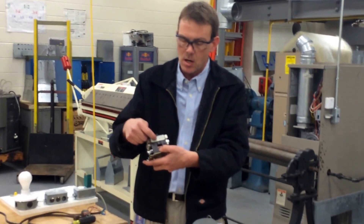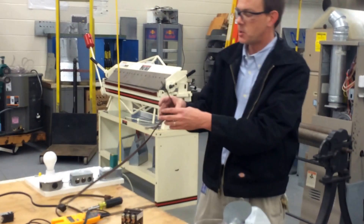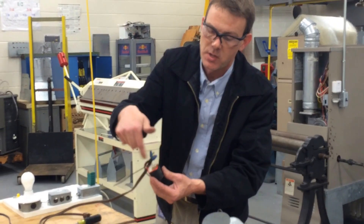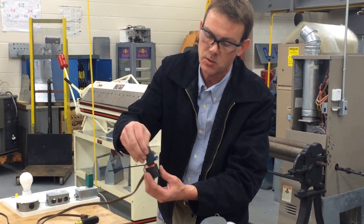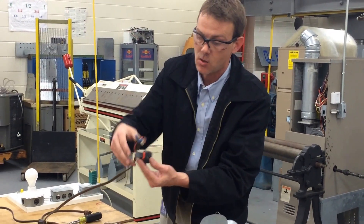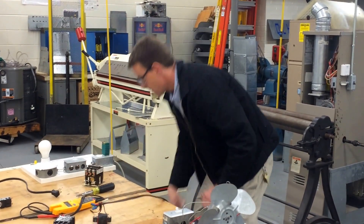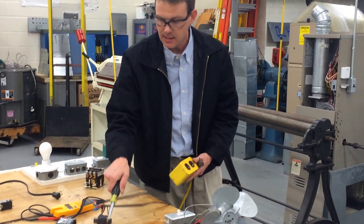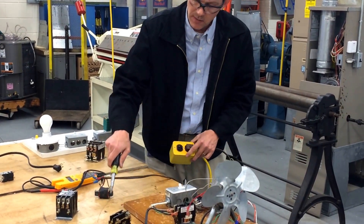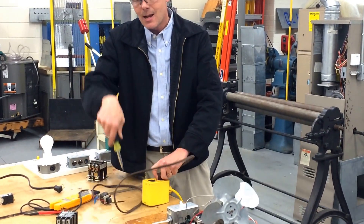Make sure you're lining up with your transformer — the type of power you're using for the coil. A contactor is essentially a coiled wire, like a spiral notebook. When you put current through it and put an iron bar around that coil, you make an electromagnet. Right now we've got nothing happening, but as soon as I apply 120 volts to it with that iron bar in the center, now we have an electromagnet. And that's really what we're doing with that contactor — it's an electromagnet that energizes and de-energizes.